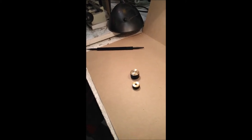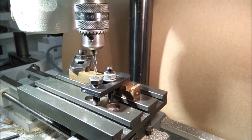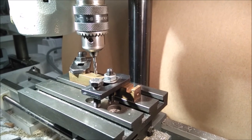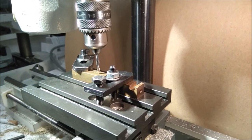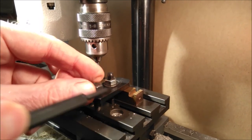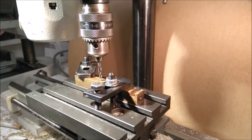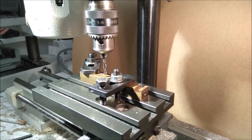When it comes to holding things on the milling machine, of course you can use a vice, as I showed you in the introduction. Or if that's not possible, you can use dog clamps - two of them here, you may well be familiar with those from smoke box doors. Essentially you can put the clamp in place on the T-slot, and then nip it up. Even finger tight makes a pretty good job, but normally you just get the spanner on it and nip it up a little bit. And there we have a piece of brass bar ready for milling.